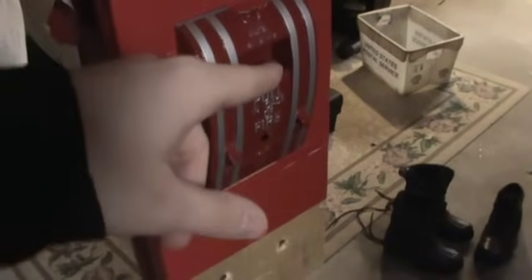Alright, let's do... I don't have code 3 on this panel. I have code 4-4, though. That'll sound cool. I'd have to download a new version of the code to do code 3, because that 8005 has such a bad memory that I can't put a lot of code into it. The new panel, though, has 16 kilobytes instead of 2 kilobytes of code space, so I was able to fit all the coding options, plus selective silence into it. You'll see. Alright, ready? Code 4-4.